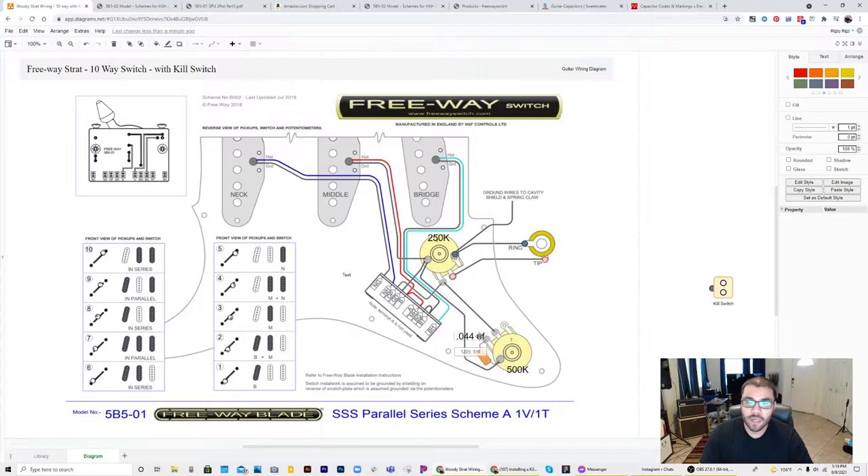We also want to use a .044uF capacitor because we want a lot of control. We have both single coil pickups that are twangier, and settings that act as a humbucker with a lot more output. So we want a lot of throw. When we're in a single coil position, we tame that by reducing the tone — sending some of those highs to ground. And when we're in a humbucker-ish setup like position 10 with the middle and neck in series, we reduce some of that so it's not as dark.